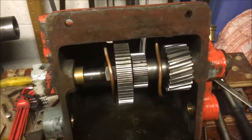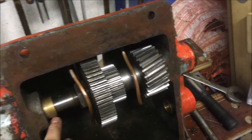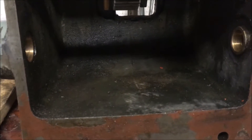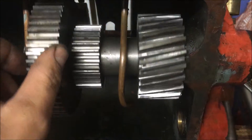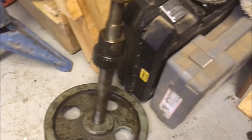Thankfully no howlers. I've got the secondary shaft and the sliding gears out. I've left this one in because I can't feel any play — I just need to flush the oil lines through, give the bearings a flush through. I'm waiting for some degreaser to come. I've taken the worst of the crap out. The bearings all look a little scored, but they're not oval. I don't feel like they've done a great deal. There's a little bit of wear on the main driving output gear, but again, not a lot.